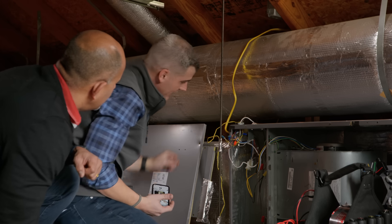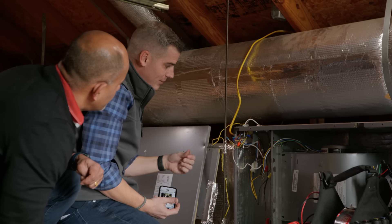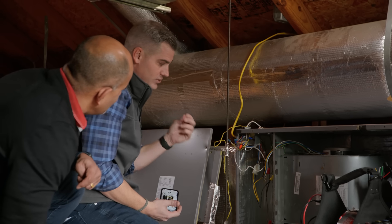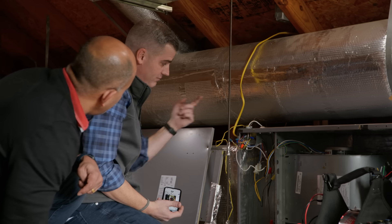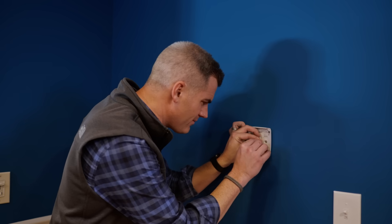So when we reconcile that — I need to see if I have continuity, meaning that do these wires actually go all the way down to the thermostat? To do that, I'm going to bundle the extra wires together with a wire nut, and then I'll come up here and verify continuity. And if we do, we're going to be in luck because one of these can be used as a common wire. I'm going to go downstairs and check that, and we'll come right back up.